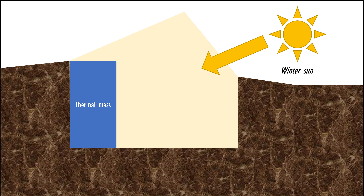Improving the design further is to add thermal mass along the wall opposite the direction of the sun, to take in that heat in the winter and slowly release it at night, preventing freezing conditions in the greenhouse. You would typically place grow beds in front of that thermal mass so they get plenty of solar gain, accessed by a pathway along the edge that gets the least amount of sunshine.